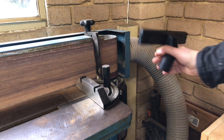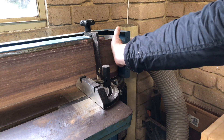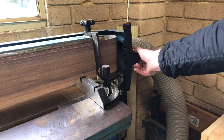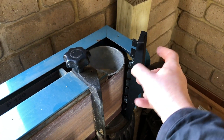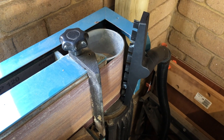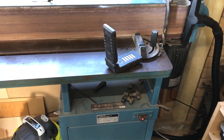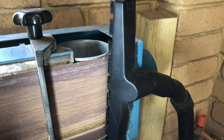What's happening is the dust is actually flying off the edge of the belt, coming this way. The vacuum pulls most of it back — probably 80% goes back that way — but a little bit comes this way off the side, and some comes straight off. So I'm hoping that by having it here I'll capture a larger percentage. I've mounted the head very close to the belt itself. I've popped the base out with the bristles and taken the squeegee off, but popped the bristles back in. Now we have a little tiny vacuum cleaner down next to the belt sander. Let's see how it works.